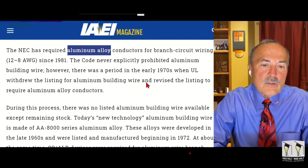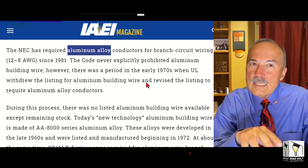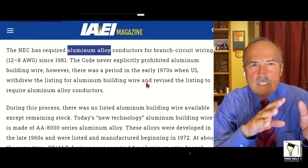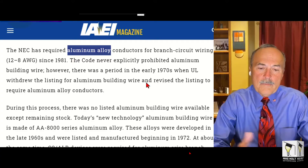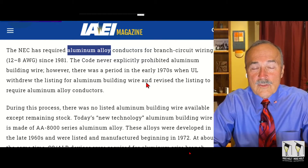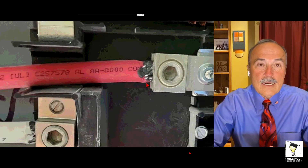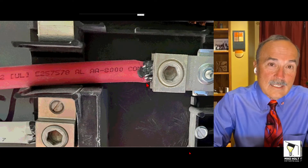Here's what it says in one of the paragraphs: the NEC has required aluminum alloyed wire. You've got to realize — today's aluminum wire is not aluminum wire, it's an aluminum alloy. One of the interesting things I learned about aluminum wire is this: the old aluminum wire, I think it was the A1350 series, had 99-plus percent aluminum in it. Aluminum wire is not as easy to bend, and if it heats up it hardens. Those of you who've done service work have seen a job where the aluminum wire is all heated up and melted, and it feels like steel. Today's wire is AA8000 — AA stands for aluminum alloy. It's the new technology.